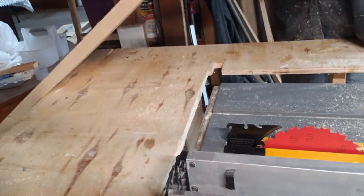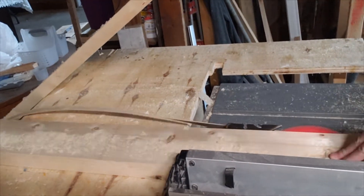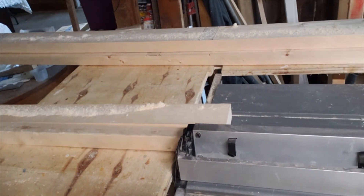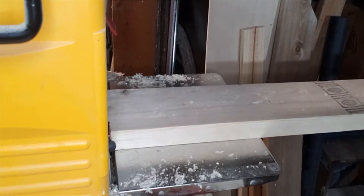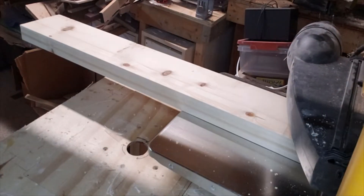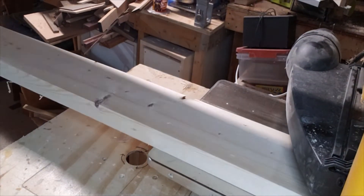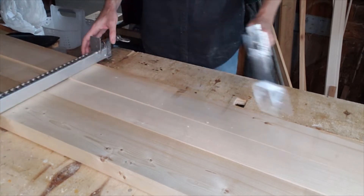It's not going to be anything fancy. We're just using some construction grade lumber, 2x6. We're going to rip a piece off of one that will screw to the wall so we can mount the hinges and the whole table can fold flat against the wall. I'm running it through the planer not because I need them particularly flat, but just to clean up each face so it looks relatively decent when we're putting our drinks on it.